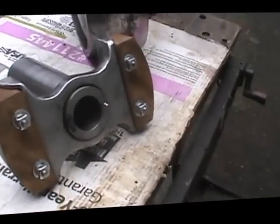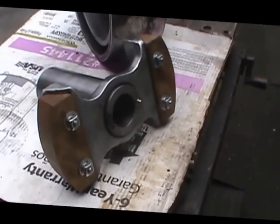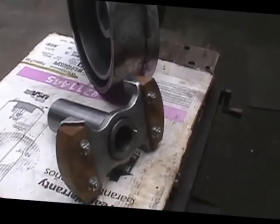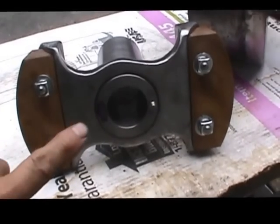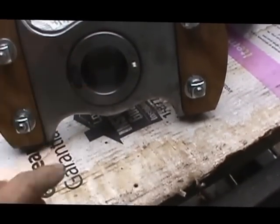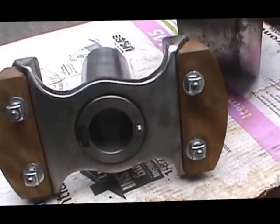We're ready to take the unit up and assemble it onto the machine shaft and complete the fabrication of the clutch linkage. Once it's assembled, we're going to put two screws in the bore, one located here and here, halfway between the spider and the shaft, for locking the spider in place on the shaft.